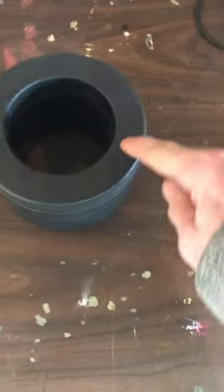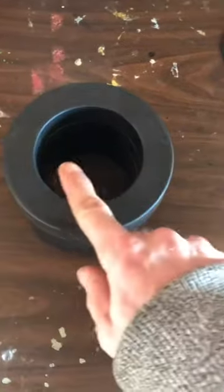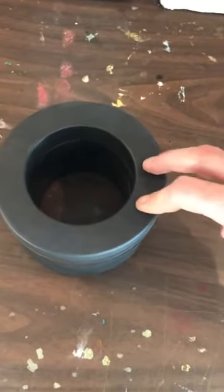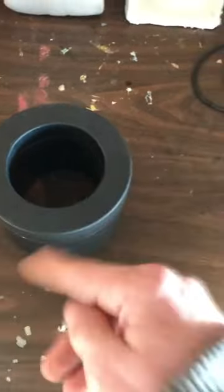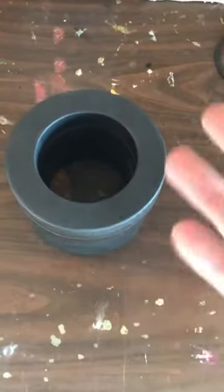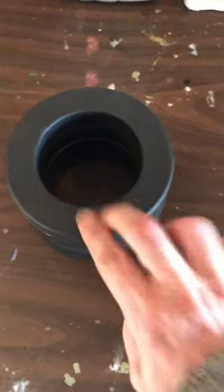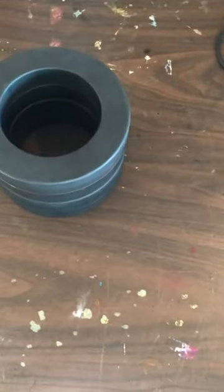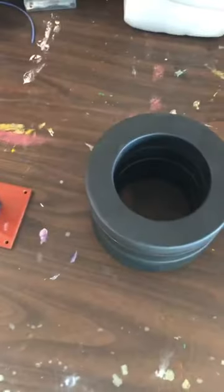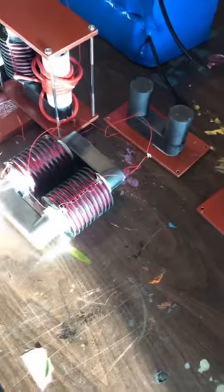primary coil, probably around 3/4 of the core, as much as you can get on there, for your transformer action. And then you could put multiple secondaries on, paired partnered coils, one in this direction, one in the other direction, center tapped, and two outputs. You could put a number of those on there to accommodate whatever you wanted. That's the goal with those, so I'm going to get to ordering some more of them. These cores are just awesome, totally unlimited. Not that the other ones are limited, but those ones are completely unlimited.